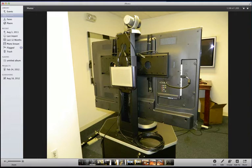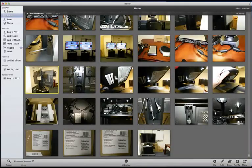So what you'll do is lift the display. It does take 2 people, someone holding one side and someone holding the other, and you'll hang those hooks on this T-bar that goes straight across. And then there is a screw adjustment to keep it sitting safe so that it doesn't pop off.